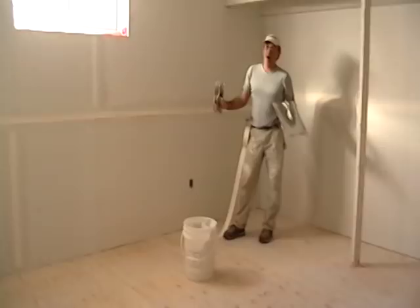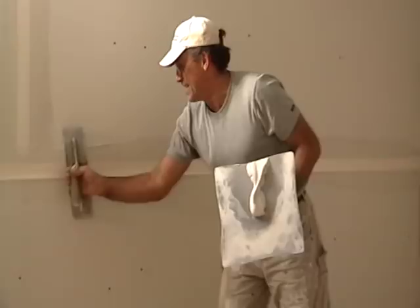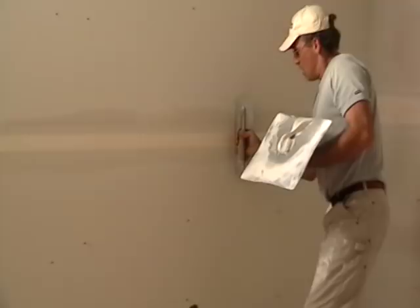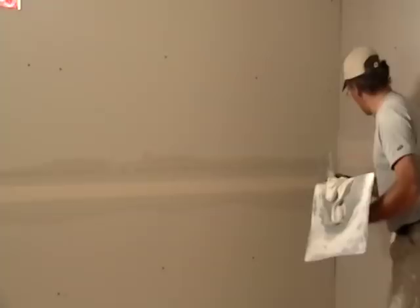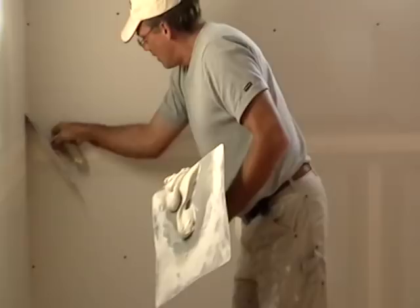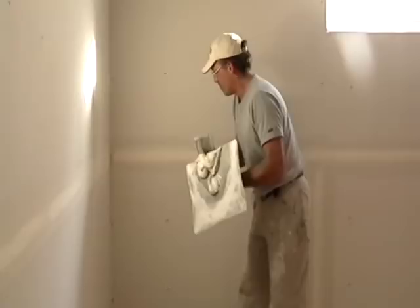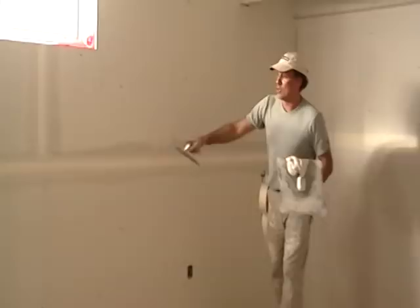I pick up my tools. These are tapered joints — you don't have to worry about how hard you push; you just have to tilt that trowel up and push hard, because it will always leave mud behind the tape since it's tapered. It's about three-eighths of an inch instead of a half inch, and that tape sits right into it. I'm tilting it really high and pushing hard. I'll use the tip of the trowel to clean off the other side. That's a completely first-coated tapered joint.